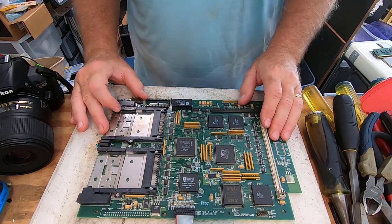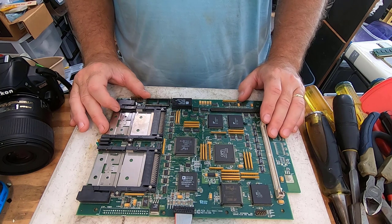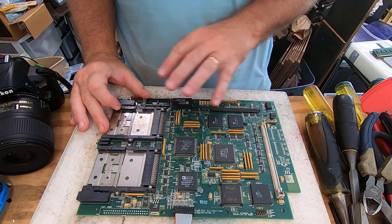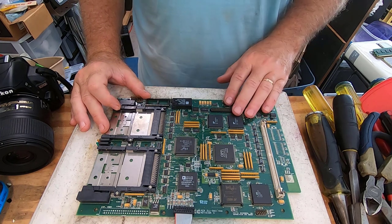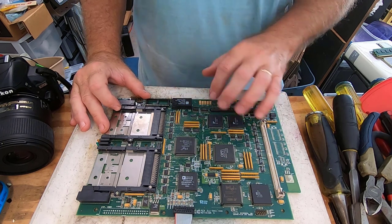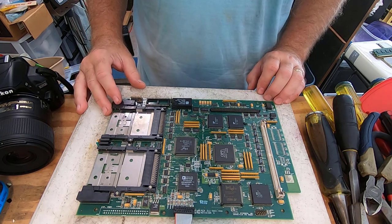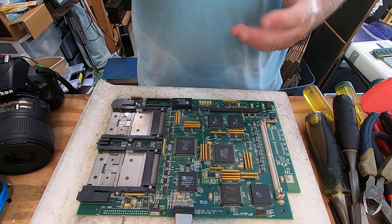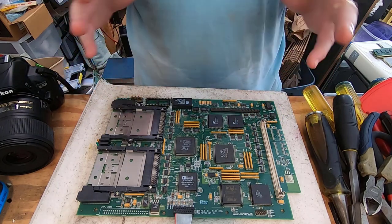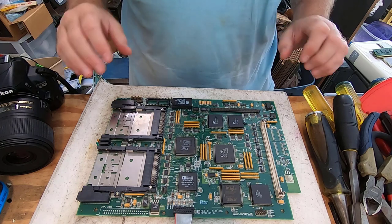This board would definitely be a peripheral board for board sort. My yard doesn't have that grade, so my yard is either going to take this as a high grade or a medium. It's going to give them some difficulty trying to assess what it is. I want to get them to take it as a high grade, so what I'm going to do is cherry pick a couple of flat packs off of it, the tantalums, and otherwise leave it populated. That way they're more likely to buy it from me as a high grade board. Now, because I have to ship things to board sort, it's not economical for me to ship board sort peripheral boards. By the time I get done paying the shipping, I might as well just take it to my yard, even though they pay a little bit less. I actually come out further ahead in profit.